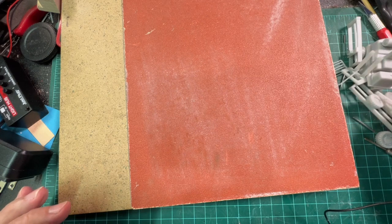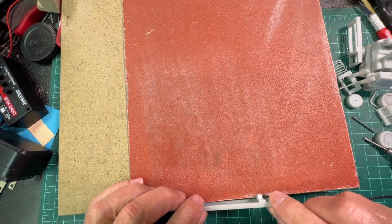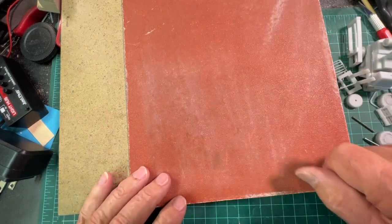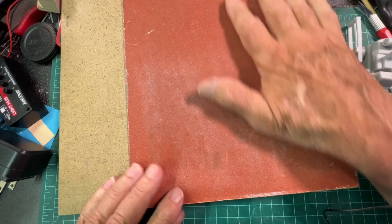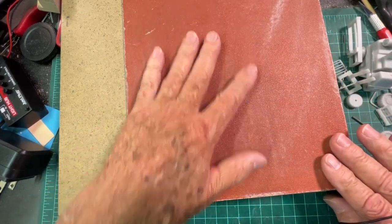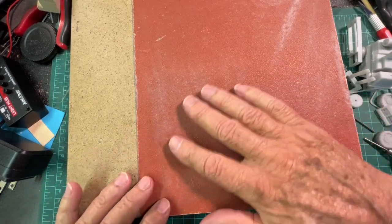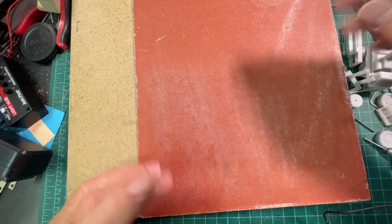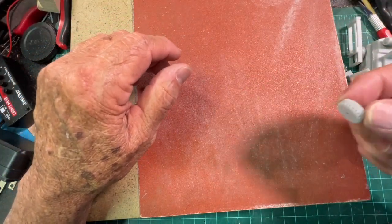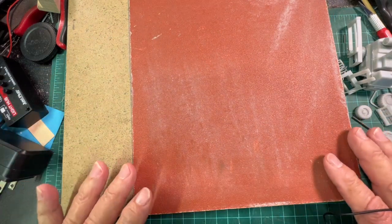That means I can come in here when I need to and sand something just barely on that edge. Stick it all down, and then I use a brayer — one of those rubber rollers — and I mat it down until it's really tight and good. Leave it for an hour or so so it can set up and really tack. And now you have something that you can sand parts — large parts, small parts, all parts — and make them extremely smooth and even. Just a great tool to make before you ever start your construction.